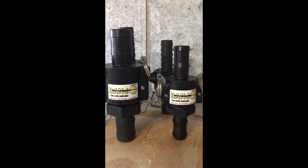The downside to the Banjo cam lock specifically is the price point — they're a little bit more expensive than others out there. Also they're a little bit heavier, which can be a pro and a con. But another con is the fact that they don't have locking levers on them. Locking levers give you that extra sense of security when you're using chemicals through them, so that way it doesn't break loose. We have the utmost confidence in these, it would just be nice to have some locking levers or clamps to make sure they're in there nice and tight.